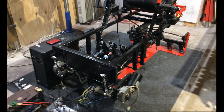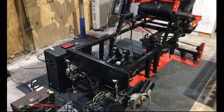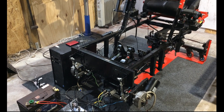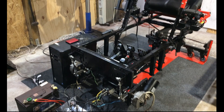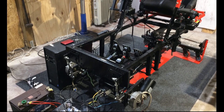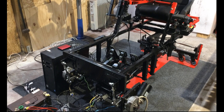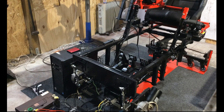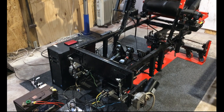With our motion sims, our H-bridges control direction — they control reverse and forward direction on our motors, so this changes the polarity of our motors. This can become a problem if our motors are case-grounded. In my case, all my motors are case-grounded, meaning if I place these straight onto my metal platform, they would in essence end up energizing the frame, because the H-bridges command the polarity of the motors to be reversed frequently and simultaneously with each other.